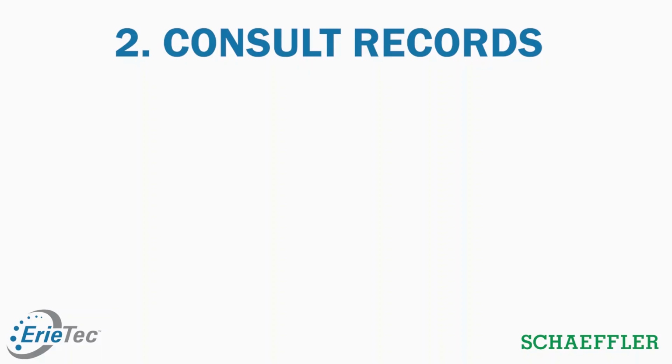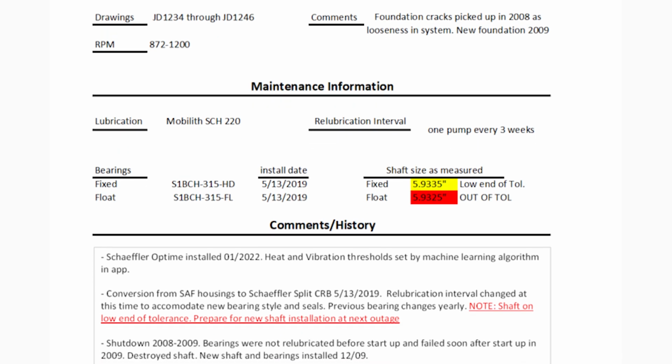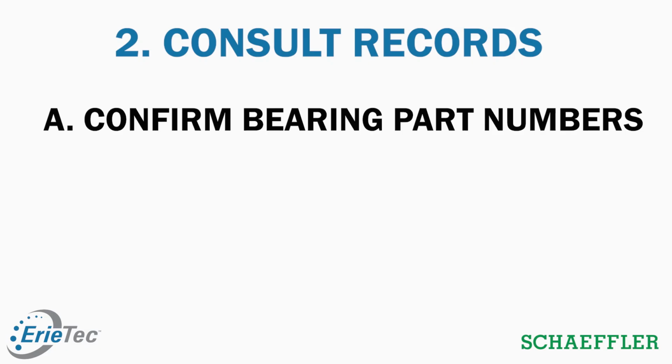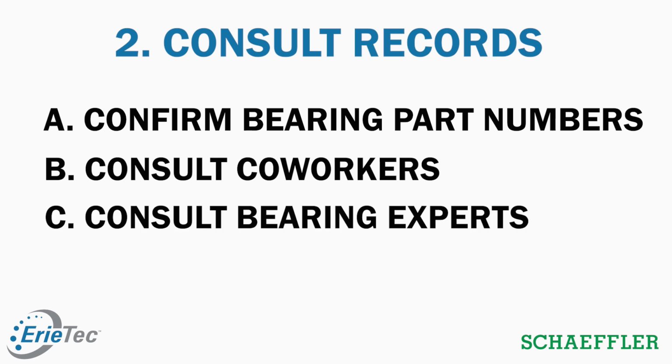The second step is to consult your records. You want to look at any previous records that you've kept or that your predecessor kept. You want to check your bearing part numbers to the original prints, make sure they match up. You also want to consult any workers who did the job previously, as well as any bearing representatives who were on site, and make sure everybody understands the tasks that need to be done.